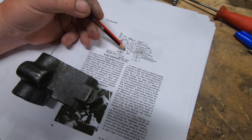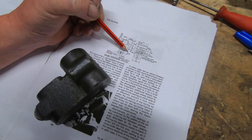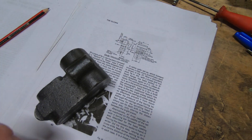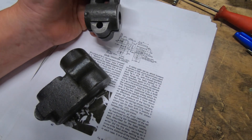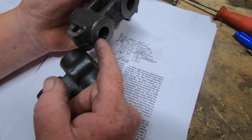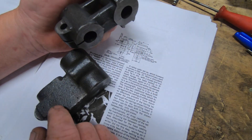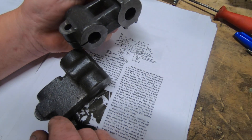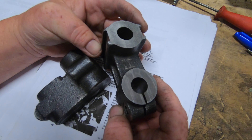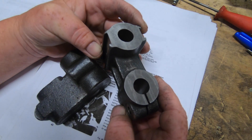The theory is I'm just going to try and hit all the numbers and hope for the best. When you read all the literature, this two-inch between centers — between the center of each bore — is the most critical. It says you should be doing all these castings off one setup: bore the 5/8 hole, then do the next hole, and have a 5/8 register on the face plate of the lathe so you can put the next one in and know it's exactly two inches. But this part was already machined prior to me getting it, so I'm just going to try and get it right anyway — we'll have a crack at it.